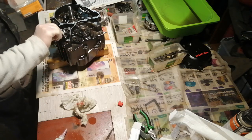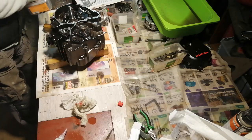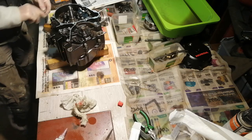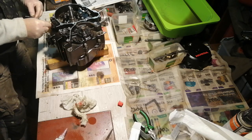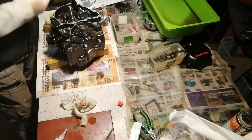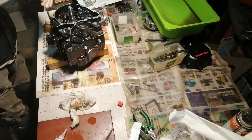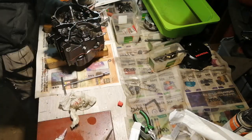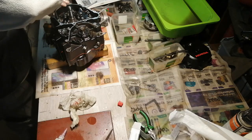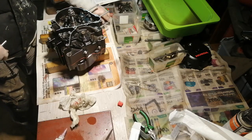Then it's the screws — and remember what I said earlier about how much the screw is sticking out. Go around and make sure each screw is only sticking out about half an inch or so. I did have to pause because one on the bottom wasn't quite right — I double checked it and realized it was slightly longer, so the longer one goes on the other side of the casing. Then tighten them all up — run them down until they touch the casing first, working in a crisscross fashion on opposite sides. Don't forget the one at the bottom, then go around hand tight — just an extra quarter of a twist.